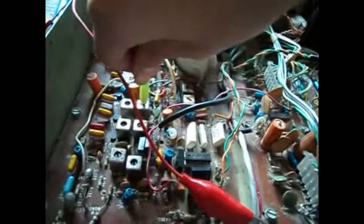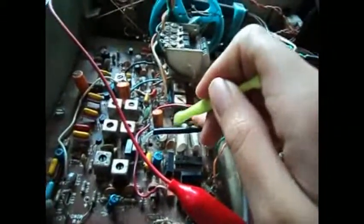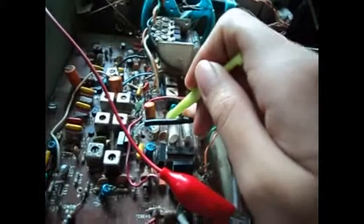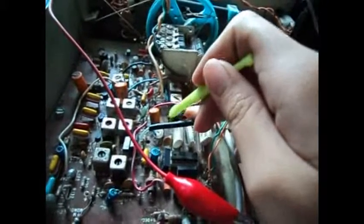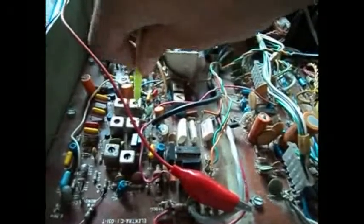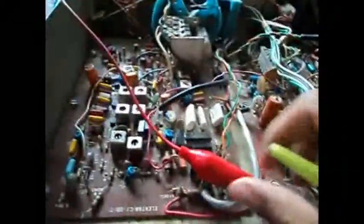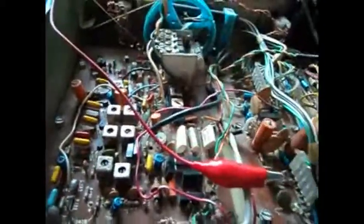So this one's the one that looked the most weird to me, and I replaced it a couple times with a couple different ones that are compatible, and it's making no difference. I also replaced this capacitor here because it cracked, and it kind of fell apart when I pulled it out. Replaced it, but no difference. Actually, the signal generator also isn't being picked up at 455. Right now I have it full blast and it's not even picking anything up.